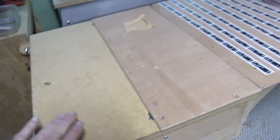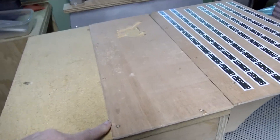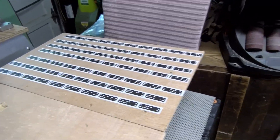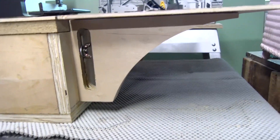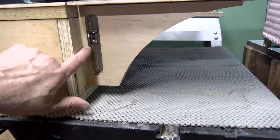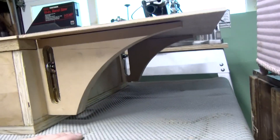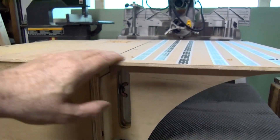To use it with the Shaper, you can see that I have my quarter-inch Luan. I've already cut out one shape, and here's the domino tape. This board is coplanar with this by means of what are called corbels, which I cut on the Shaper from his SVG files. You can see that they ride on a 5/16th inch bolt that comes through the carcass and they're held by wing nuts — one there and one there. This can be raised and lowered so as to get it in line with the material.